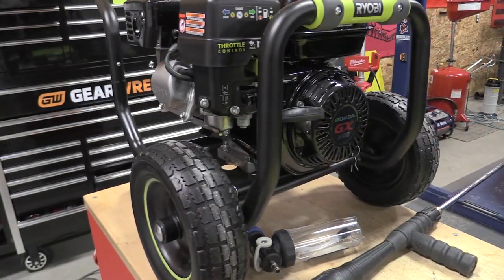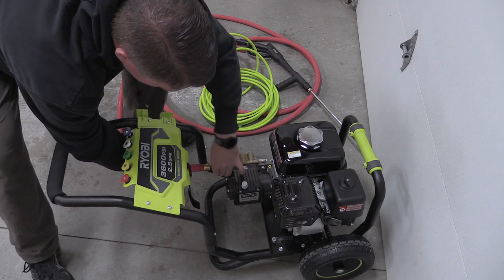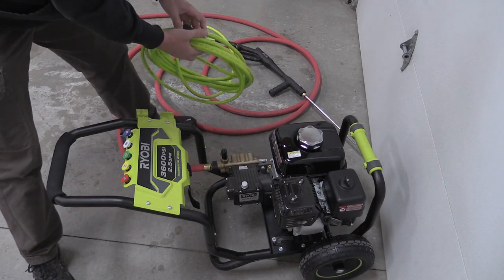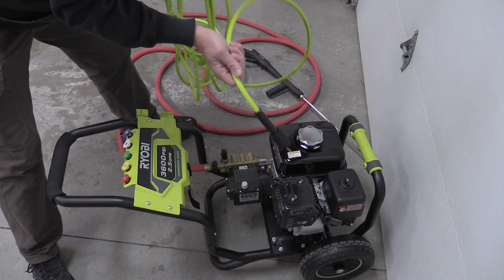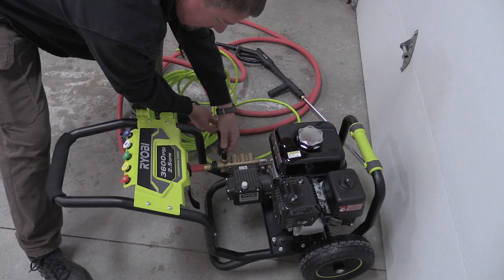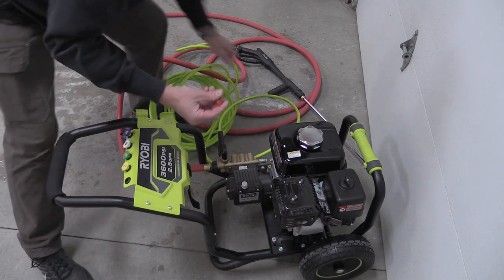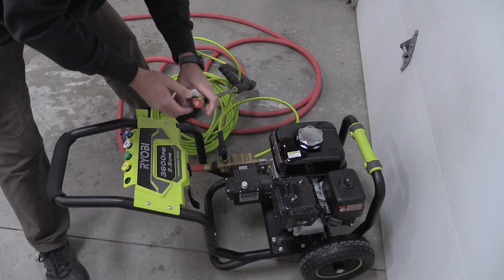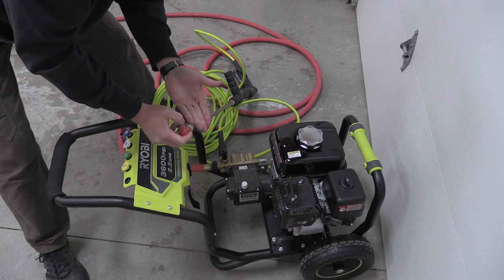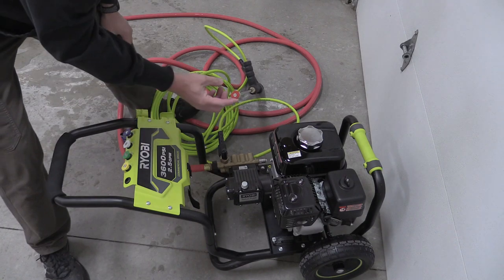Let's get out and do some testing to see where it falls on the advertised specs. Connecting the garden hose up back is simple — there's plastic around the connection so it's easy to grab onto even when wet. You can see the hose here and how it all fits together, especially when it's a little cold — it's a mess, which is why I'd highly recommend replacing it. It screws into the side and the quick connects are simple and easy to find. We're going to use the zero degree tip on this test — pull back the quick connect, push it in, and always make sure by pulling on it that it's fully seated. If it wasn't fully seated you could actually push the pressure washer handle and this could come flying out, potentially hurting something.